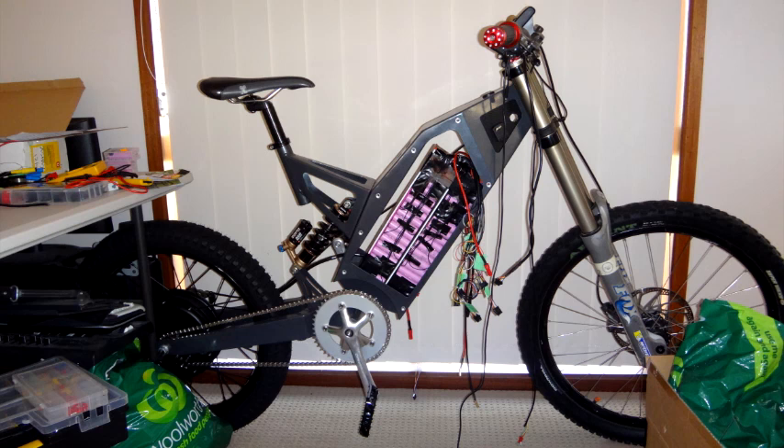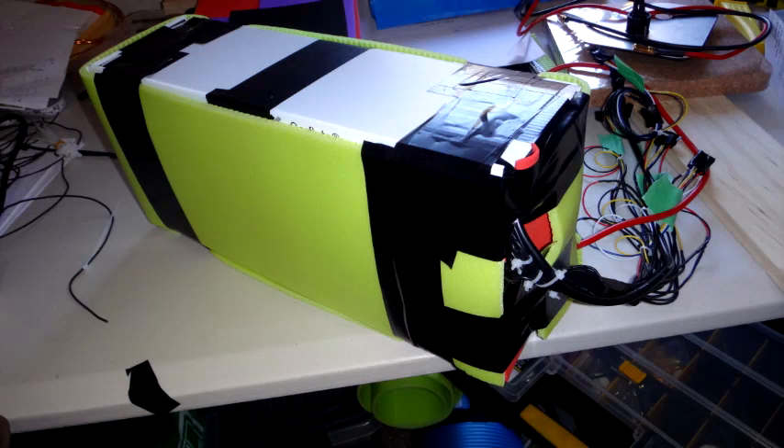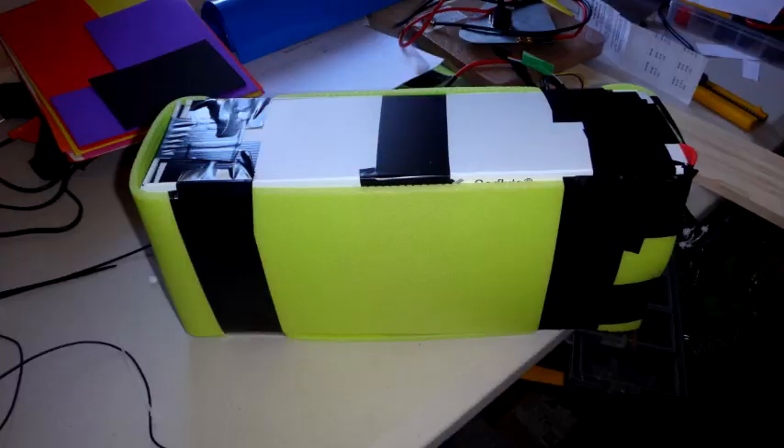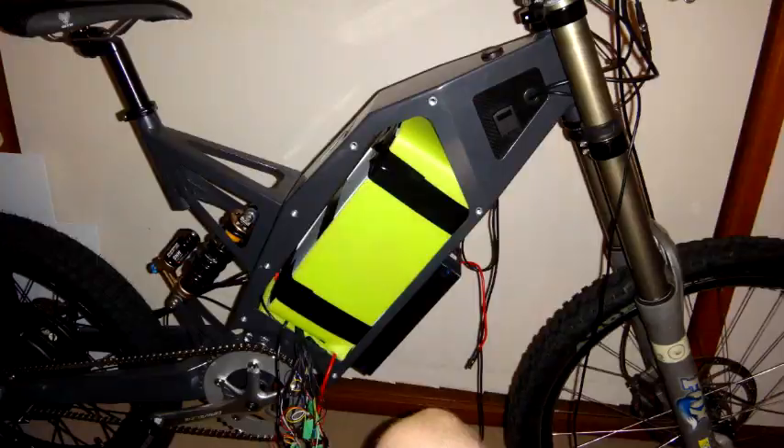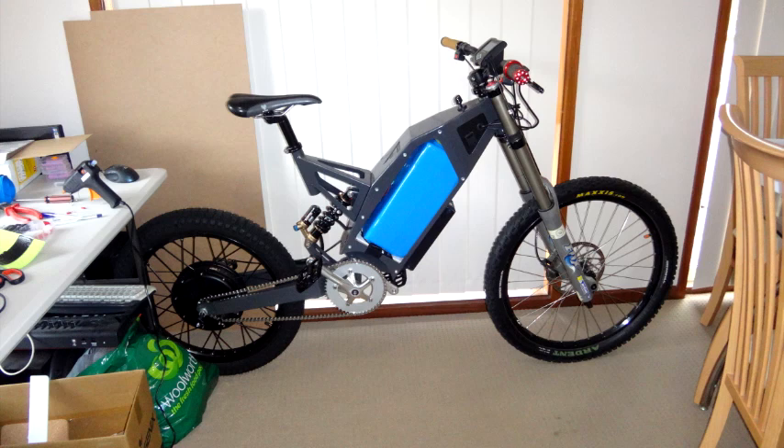Here's the first test fit into the bike and I was pretty happy because everything fit with plenty of room left for padding. The balance leads and BMS wires were a little short, so I did have to lengthen some of them — definitely make them as long as needed. I then added foam protection using gym mats of different thicknesses from Kmart, and did another test fit to check the thickness. Next was applying the large heat shrink wrap bought from eBay — pretty cheap and it worked really well, making a nice finished pack. A final test fit showed it fitting in well, though more snug with the padding in.